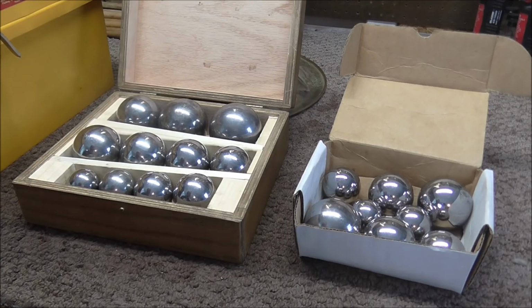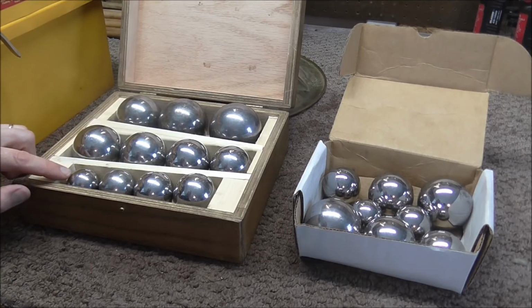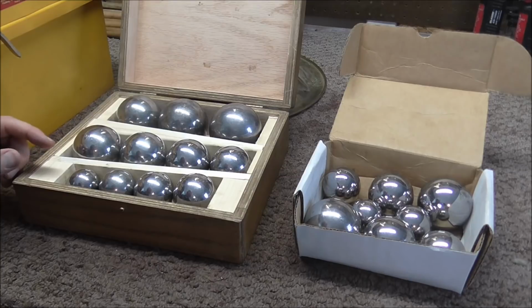The way that they partially get around that, on sizes smaller than this, they have two dent balls of the same size, and you put those two dent balls in together, and then on some of the really small dent balls, they put up to 4 dent balls of the same size in, and that can help a little bit, but still there's not enough pull to get out the dents on some of the smaller tubing.